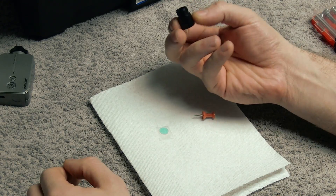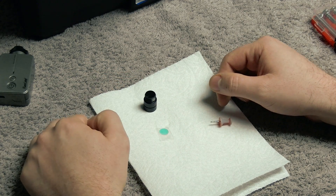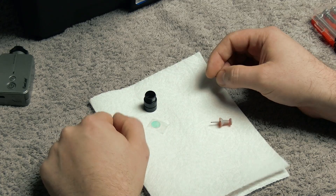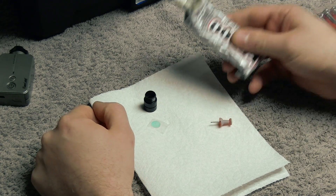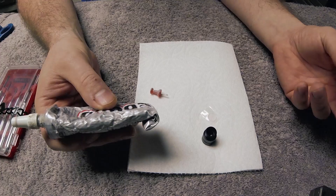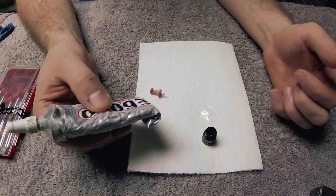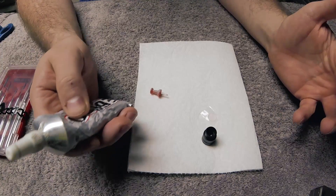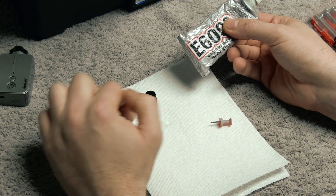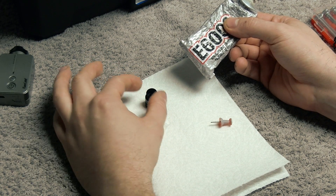To make this work properly you need an IR blocker to block out infrared light, so we're going to install that in here. To do that I'm going to use a little bit of glue — I like to use this E6000 because it's non-penetrable, sort of rubbery. It glues stuff together but doesn't go into the product. Just going to get a drop of this, put it on the edge, drop this in, and that will be what it takes to prep the lens.